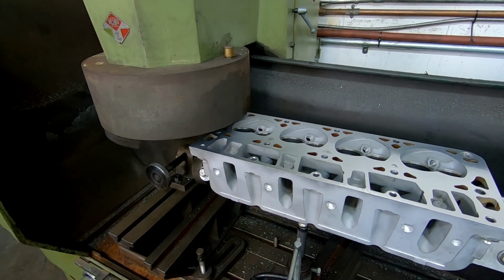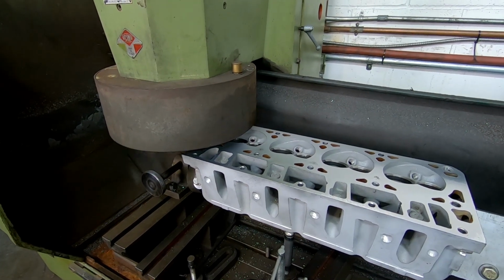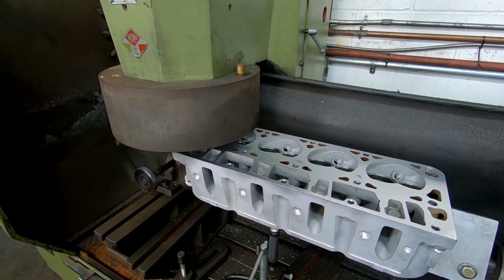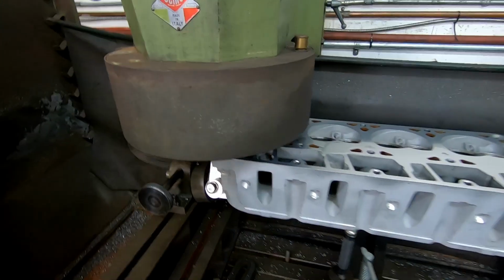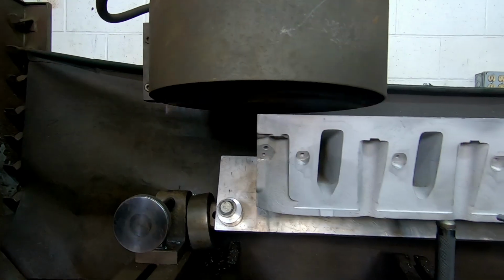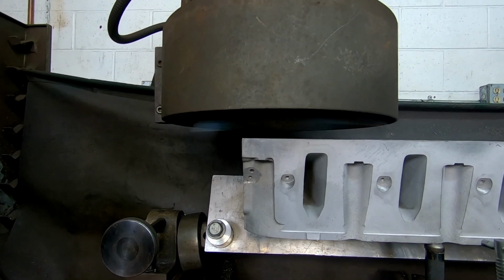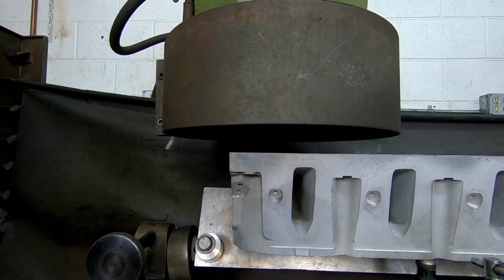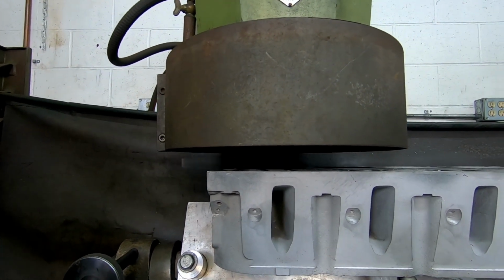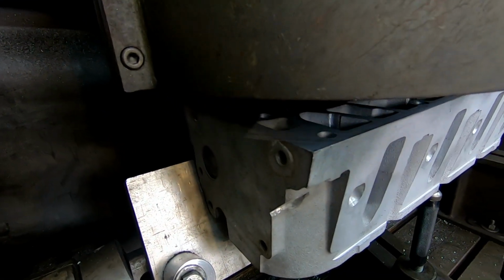I don't know if you noticed or not, but it's moving slower than those last 2 cuts, which were what we call roughing cuts. And it won't actually touch anything until we get to this half of the fly cutter here. All resurfacers have a slight little tip. I've measured this one to be almost 2 thou of a tip, so it'll only cut on one side. That way you won't back cut on your cylinder head, which will actually mess up your finish. There we go.